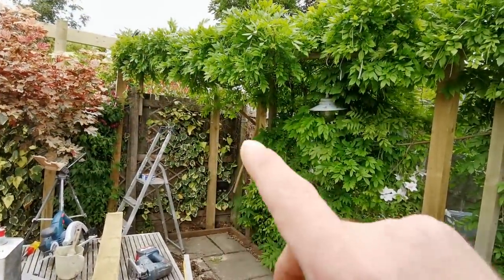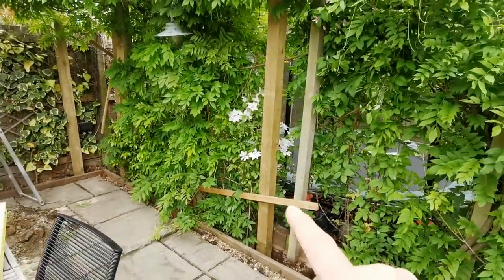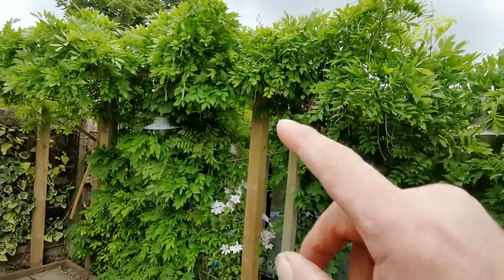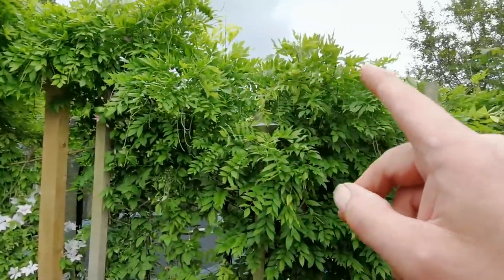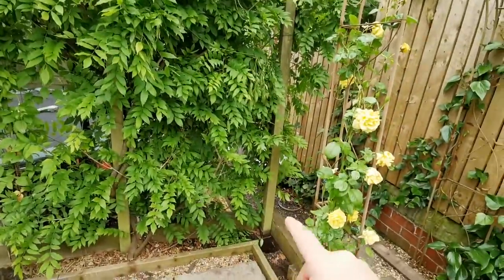Right, so I've braced that one in the corner both ways, so that's plumb. This one I've got a brace ready to go on it. It's half lapped at the top, notched, whatever you want to call it. What I'm going to do is sit this timber on and I can level through so I know the height of this one.